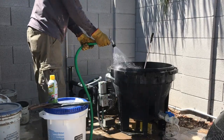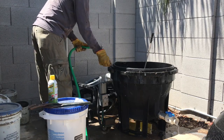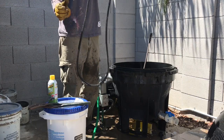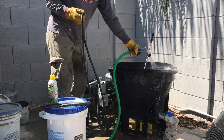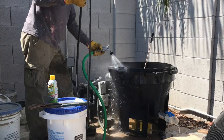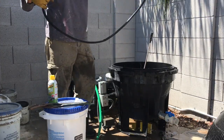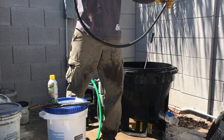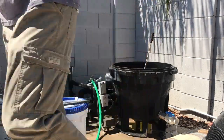Now I'm cleaning off this O-ring. If you want to pull it off to do that, you can. And if you do that, I would take it over to your pool and clean it off and then put it back on. But if you do that, hose off the rim that it fits in so that there's no debris in there. I tend to pay attention to which way I pulled it off. I'm told that it doesn't matter which is the top and the bottom. But also when you take this into the pool, don't pull on it really hard and don't get crazy with this. I'm gonna go over there and do that. I'm not gonna have you watch it, and I'll be right back.